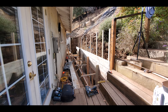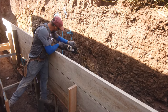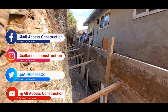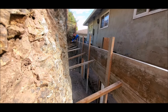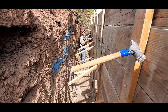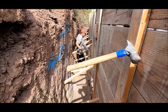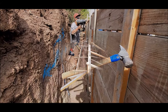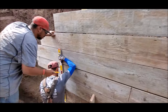Our main stakes are approximately five feet on center. With the rock being so hard, we had to pre-drill some holes using our Makita rotary hammer to hammer our stakes and kickers in. This process can be time consuming, but we make up that time by using a duplex nailer as opposed to a hammer. It is a challenge working behind the wall — we have to make sure each kicker is secure.